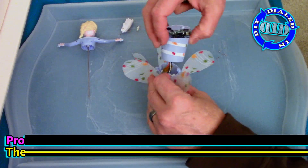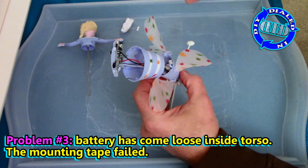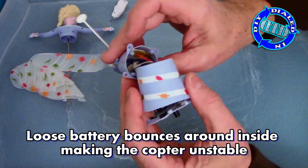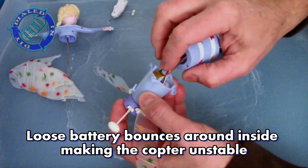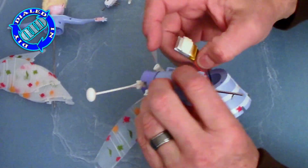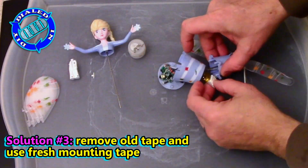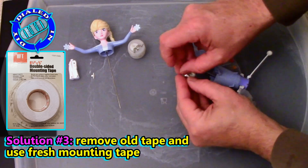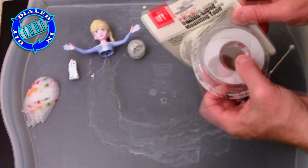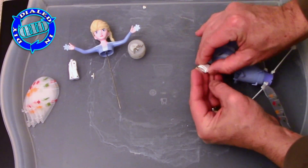Now I was able to find an easy and glaring problem that is pretty easy to fix. There's double-stick tape on the back of the battery that's supposed to hold it against the side of the copter and it's not working, so the battery's loose. When the copter tries to fly, it's bouncing around inside making the whole thing extremely unstable. All you have to do is pull out a roll of double-sided mounting tape — often used for hanging pictures — put a little piece on the back of the battery, stick it back on the inside, and make sure it's firmly attached and can't move around.